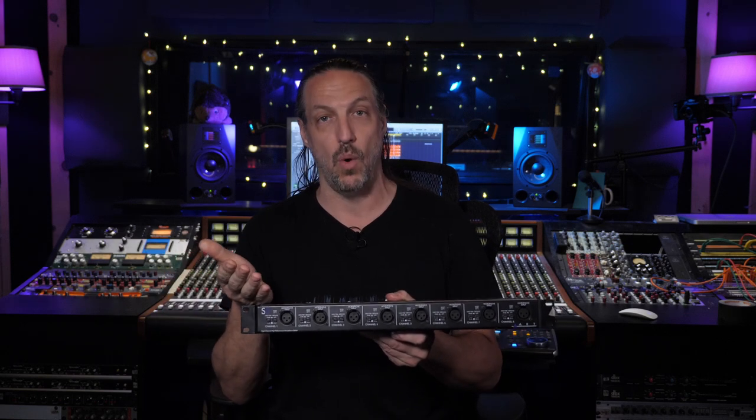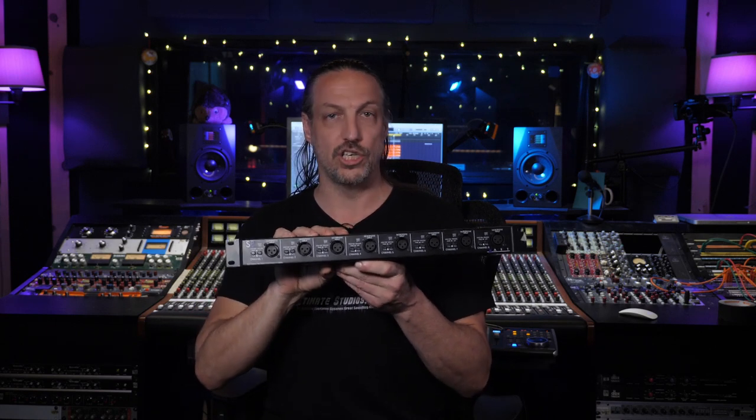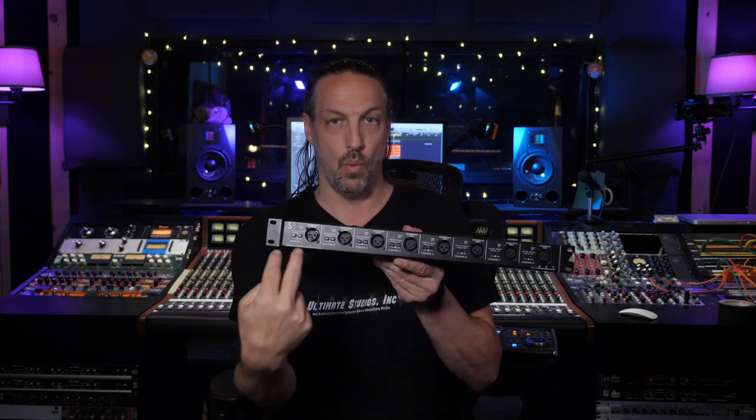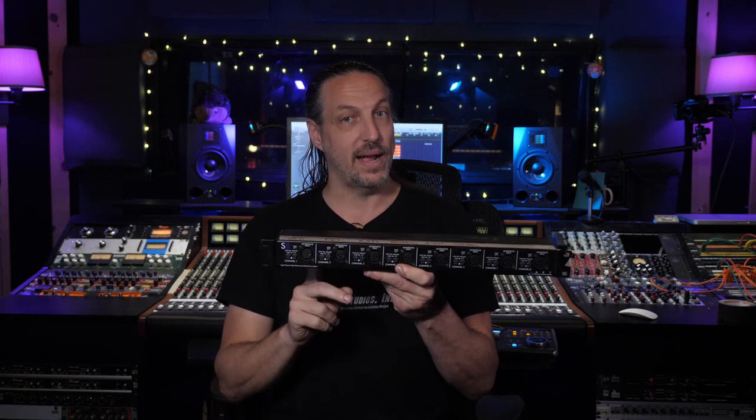I use the ART S8 — I've used this for years, it's built well, sounds great, I've had no problems. There are more options out there, and if you're DIY and handy with the solder you can always build one. This is a one-to-two mic splitter: one microphone comes in and at the back you can split that mic to two different destinations. It is passive — there's a direct out and a transformer-coupled output.